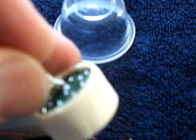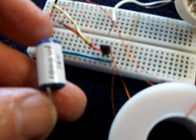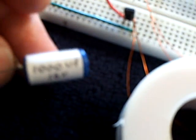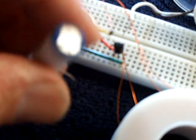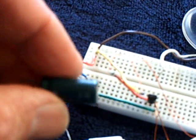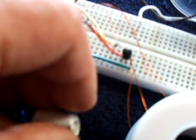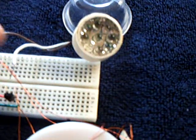I did want to thank you for what you did. It was a reminder of how we could be deceived with these devices that appear to be running in an over-unity type of scenario when all they are is a deception. And this is an example of that. Someone's going to say he's got a button cell in the back of it — well, no. There's no button cell in there. This is just the lights. This is a 5-farad 2.7-volt super cap that I've simply put a label on, and this is what you showed in your videos — how easy it would be to peel a label off one of these super electrolytics and put it on a super capacitor and make it look like it was running extremely efficiently.